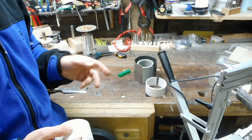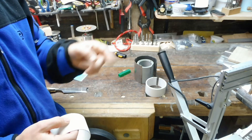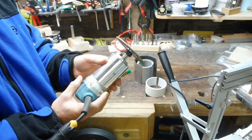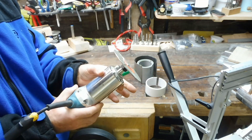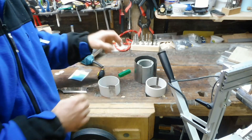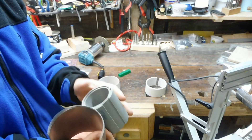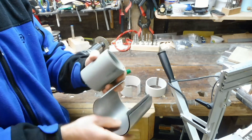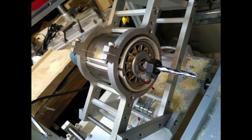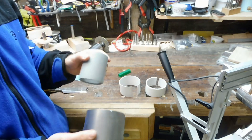This method works quite well. While I was waiting for this motor, in the first weeks I was even using a small Makita router with a 65mm diameter, and I was able to make a spacer even for such a large gap. Here you can see I used all available types of pipes stacked together, and I also used thin metal sheet for very fine adjustment. Even in this way it works quite well, and the router was well-centered in the clamp.